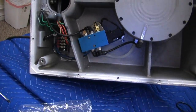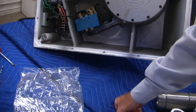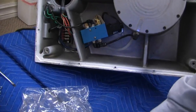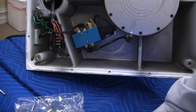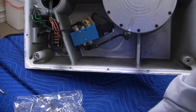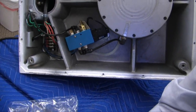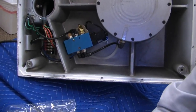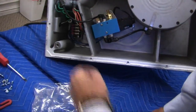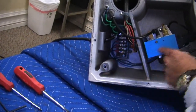We have an older valve, folks, and if you're seeing older machines, you'll see a plastic gray or blue housing. It's called Rexroth. We've replaced it with this automatic valve in recent times, the last 3 or 4 years. And this is a universal bracket that matches the old one to the new one, so it's retrofittable. We don't supply the Rexroth anymore. Okay? And of course, this is connected here, how you can check your voltages coming in, et cetera, to the valve.